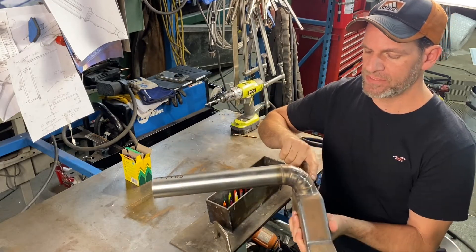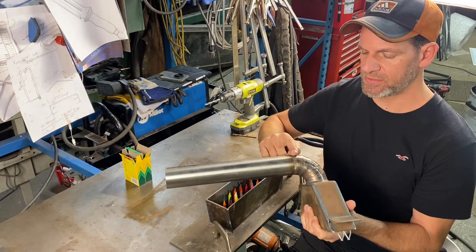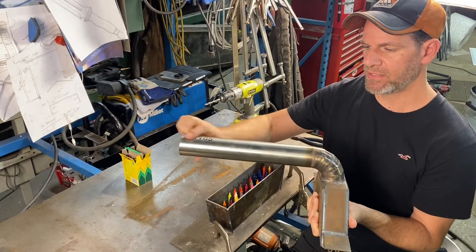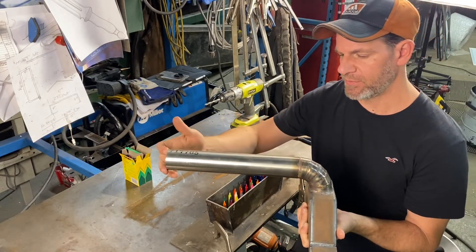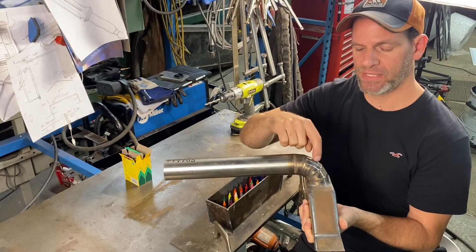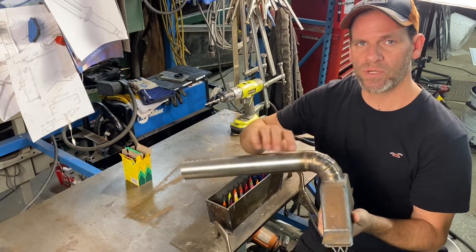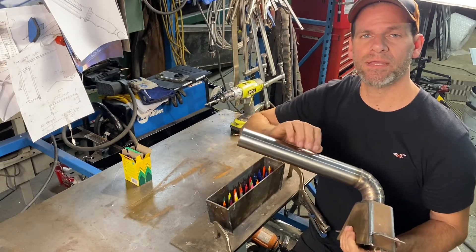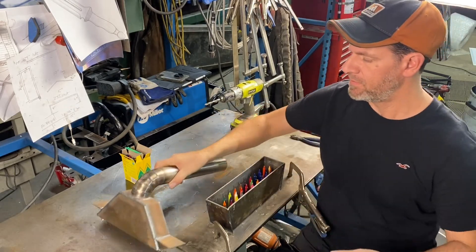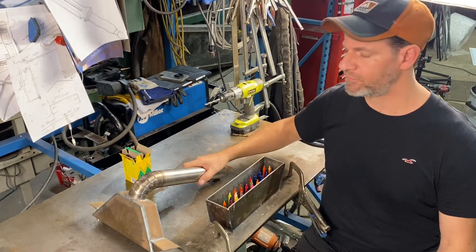The only difference is that I have this two inch stainless tube, and I pie-cut some cutouts so I can make this turn — this 90 degree angle. This is where my forced air is going to come in from, and I'm going to place a jet right here. What I'm going to do right now is I'm going to turn down that jet out of some 5/8 hex bar on my lathe, and it's going to have a 1/16th diameter hole, and that's what my propane is going to feed this ribbon burner through.